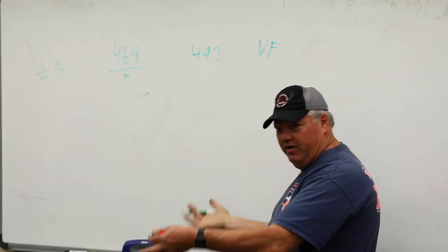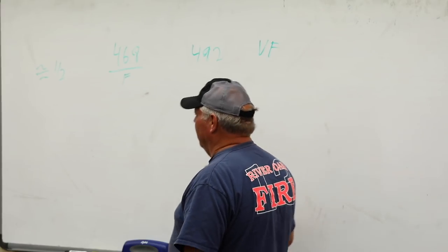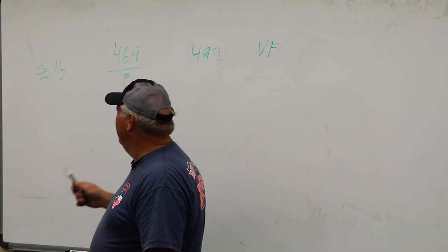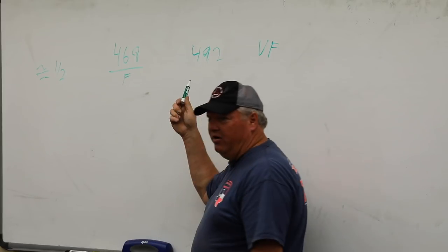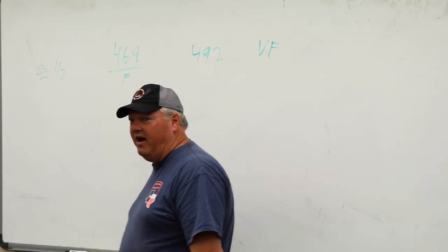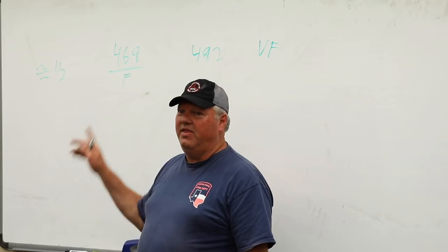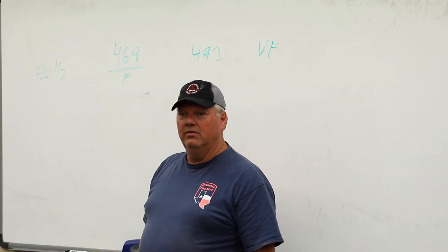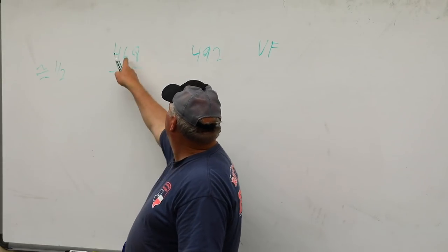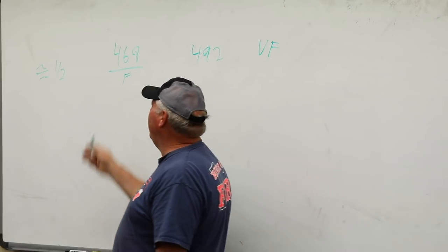It doesn't slow it down. So for a really good wire antenna, you can figure about a velocity factor of 0.95. Anybody got a calculator handy? Take 492 and multiply it times 0.95, and what do you get? Remember that these numbers are approximate because even that number is not exact. 492 times 0.95 is 467.4. Thank you. So they rounded it up to 468.